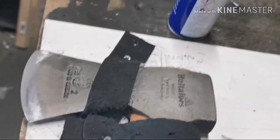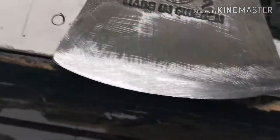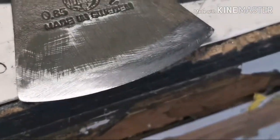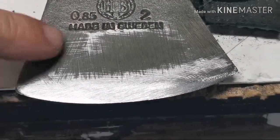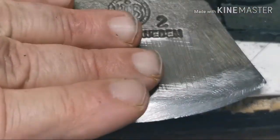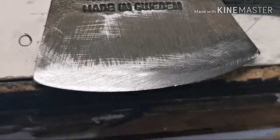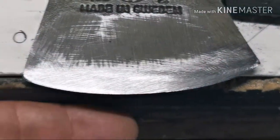So I've filed the other side of the head the same — didn't take as long because I knew a little bit more what I was doing. It's back to about 1.5 centimetres, so I'm guessing that's back to about 20 degrees. I'm getting a little bit of scuffing here — I think there's a high spot, and on the other side in the same place there's a very slight hollow. I'm going to hit that with the wet and dry to tidy it up. Then we'll see about putting the micro bevel on. This thing is bloody sharp already — I can imagine it's very cutty, but fragile, so I think we'll put a micro bevel on there once we've tidied it up.